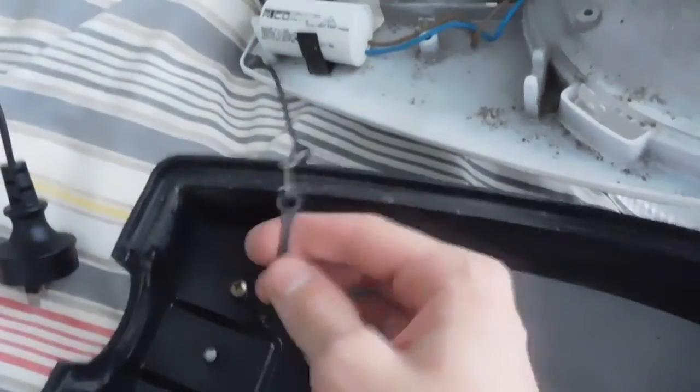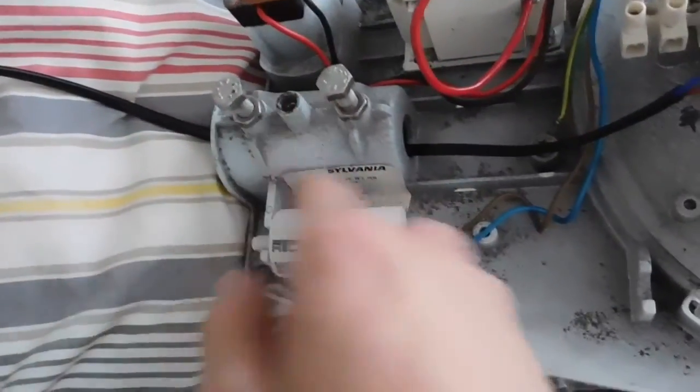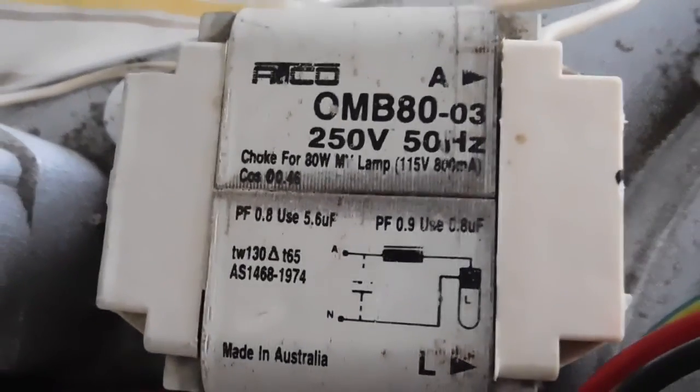It's in very good condition — there's very little rust on the outside of the casing, just a little bit of a crack on the diffuser, but that doesn't matter too much. It's very easy to get apart, and that's what I like so much about Sylvania's lamps. You can literally just undo the two bolts and the top cover will come off for servicing. It's polypropylene, and there are more safety straps to keep it together while you're working on it. There are your spigot bolts — your spigot goes in there and you tighten them up to hold the lamp onto the post. The ballast is made in Australia — this whole unit is made in Australia, down in New South Wales.